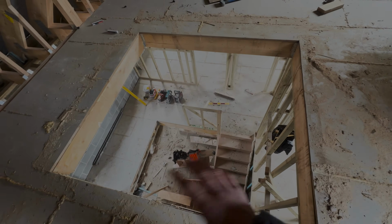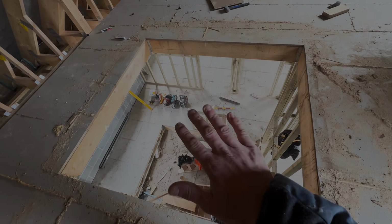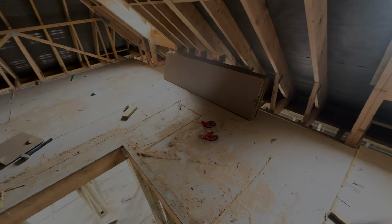Right, so now you can see I have stripped out the temporary joist with the overboard over the top. I've also put this platform up so then we can put a timber along the wall, put some 8x2 joists across and tack this wall. We've kept some of this flooring because we're going to use it later.